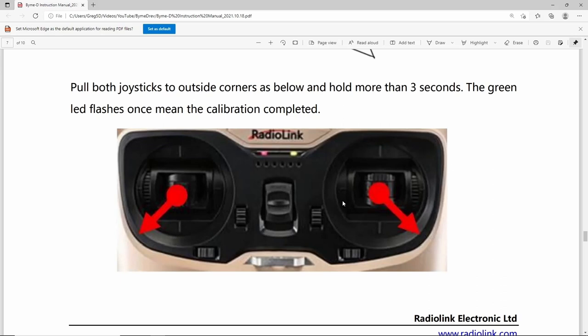To set the attitude on your transmitter, pull both sticks down and to the outside corners. This can be a gotcha — you may find that this doesn't work with your particular radio setup, usually due to the configuration of the end points. In your transmitter setup make sure that your low point is at 1000 microseconds, the midpoint at 1500, and the top at 2000, otherwise this may not work.